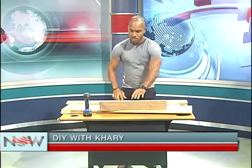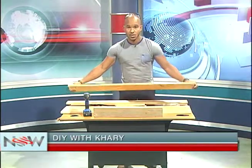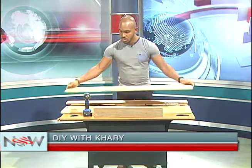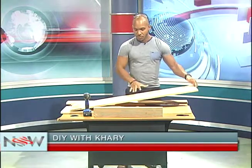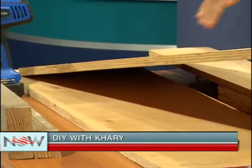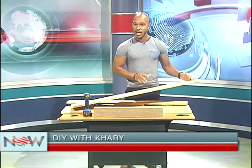Aside from that you're going to need plyboard — three quarter inch plyboard, marine ply. It's very sturdy and good to use for this. Marine ply also has nice wood markings that make for a nice finished product once you sand it down, stain it, and finish it. This is cut to four feet in length and one foot in depth. I have two pieces like that — they will be the top and the bottom, and we will not put the bottom on today.